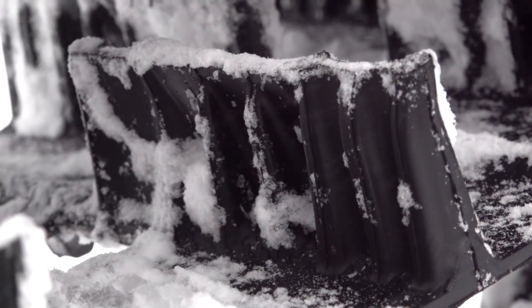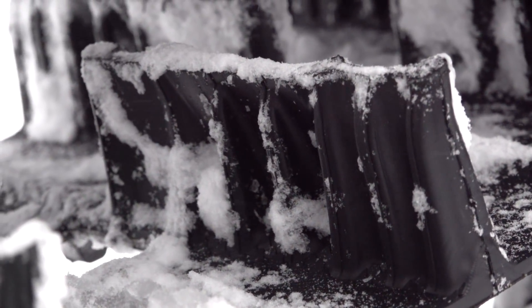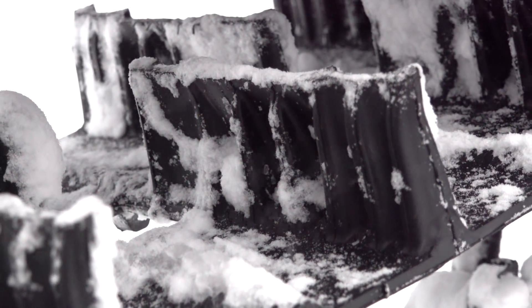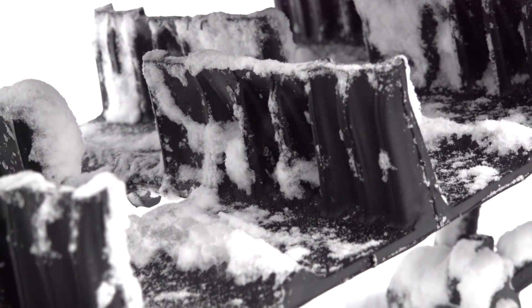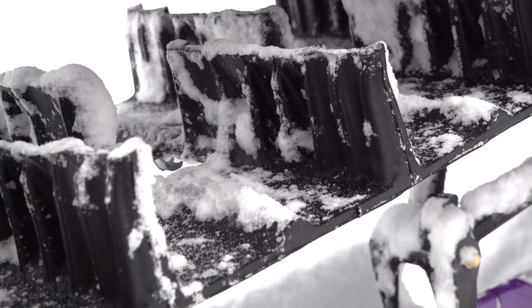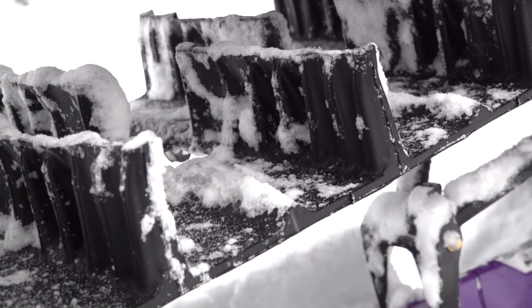The internal construction has full width rods — it's a 15x165 on this model. The full width rods provide support to the track when it's being supported from above by the rail in the middle. It spreads the load out to the entire width of the track, again going after flotation.